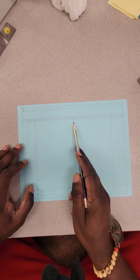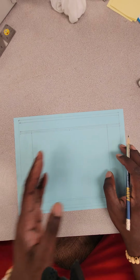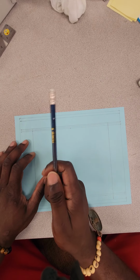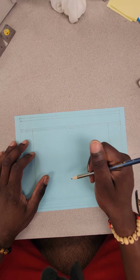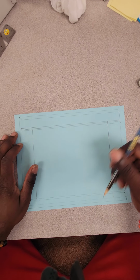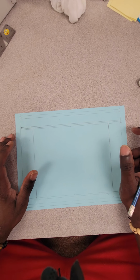Now, we can get right into drawing our studs, right? So, again, you know how we did the layout. The individual layout started from center. We're going to have 12 studs going here because we're using a 12 by 15 wall. Still the same. You're going to lay this out 3/4 inch both ways. You're going to have that extra stud. This extra stud at this point is going to be used for something else at some other time, like in the door opening, because we're going to put a door in here. So it's going to be adjacent. Door is going to be a center, but usually what happens is you've got to add more studs to compensate for the actual door itself and the header and everything else, which we're going to talk about in a second.